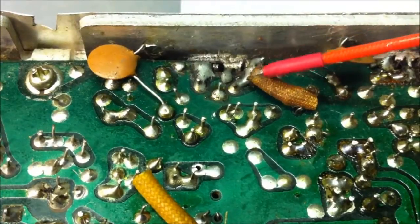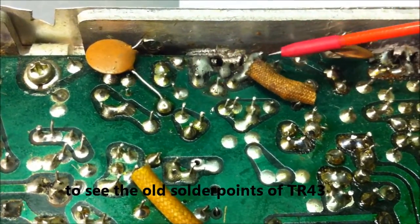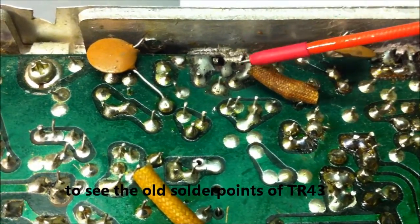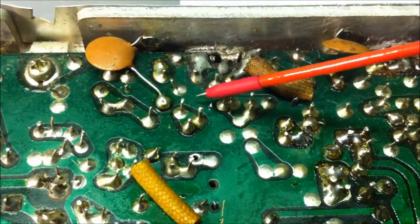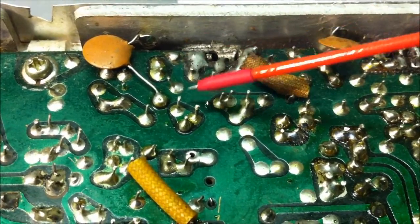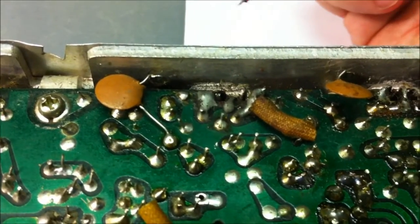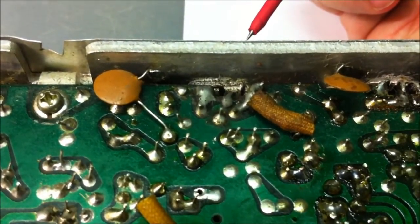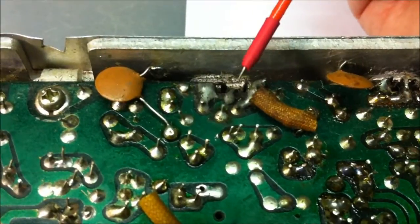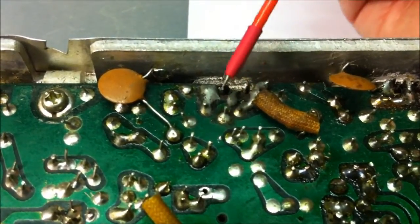This is the soldering point here of transistor Q43. This here is the base, this is the emitter — goes to ground here. Ground. And this is the collector. And now we have a problem with the 2SC1307 or 2SC1969: the collector and emitter are on the reverse side here. That's the problem.